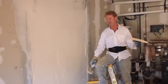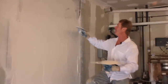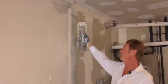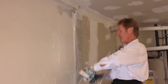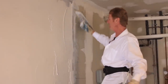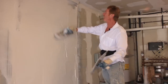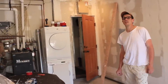We are done with the five-minute stuff. We've got a lot of slobbers here. Now I'm using the relaxing stuff — this 20-minute mud will cover these big gaps. What we do is squeeze it into those gaps like so. Because we're feathering a lot of stuff in, I'm just going to put a fat coat right here where it needs it. If it starts to hang down like that, we just go over it again and again. This wall is going to take another hour to hit. While I'm here, let me introduce you to Mike, the GC who built all this. He specializes in electricity, plumbing, you name it.